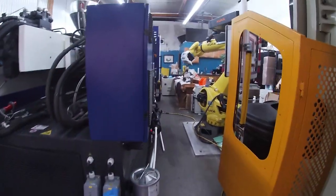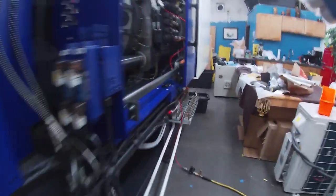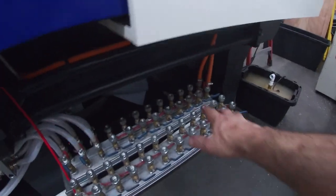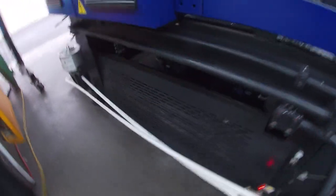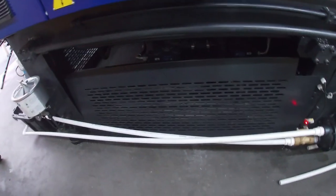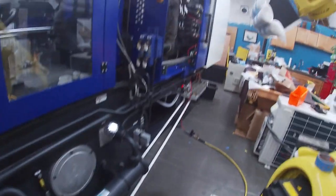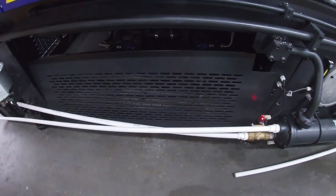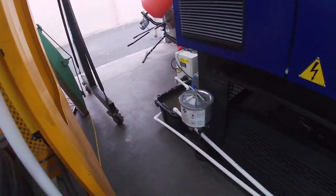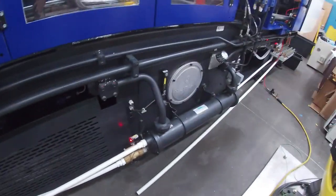So what I'm going to do is eliminate this back bucket of water and pump and everything, and tee off this manifold to this front water circuit. Again, this is all temporary until I build a whole house water cooling system. But the idea is to connect with a tee and probably a valve so I can meter the circuits of water, everything back to this back pump and that chiller. So that's what I'm going to do next.